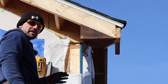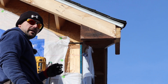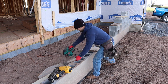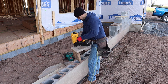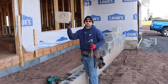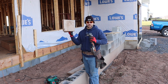I've got both measurements, so I'm going to pre-build the L shape that goes in here on the ground and then secure it to these pork chops. It's pretty straightforward — just taking a piece of 2x10, cutting it into a couple of pieces, making an L shape that's more or less half a box, and nailing it together. We need to get holes in from this corner to the inside because we're going to set it up where the bird box is and drive the screws into the side of the house.